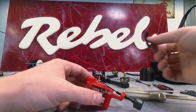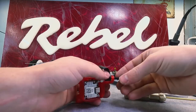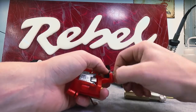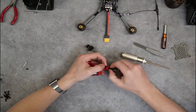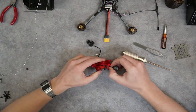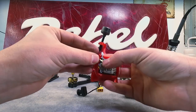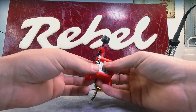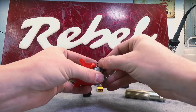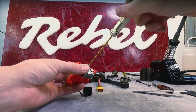To make sure that antenna isn't going to get popped off in a crash and put all of the stress on the UFL, we're going to grab a little strip of electrical tape and wrap it around the base of this antenna tube. Grabbing the tube and not the antenna, we'll just roll that on. Now the antenna can't get pushed down too far and it can't get pulled out either — very secure. We'll plug that onto the UFL port — just press until you feel a nice little click. Then we'll take that door and swing it back over as an insurance measure to make sure that UFL doesn't come separated. We'll take our 1.5mm driver and just snug that screw up.